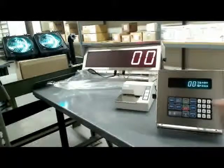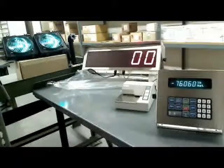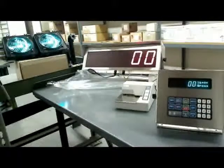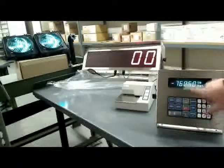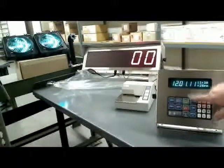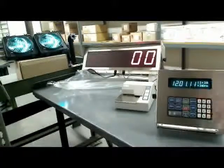If you hit Select, it'll go to Net — don't worry about negative nets. This is all done during the calculation of looking at axles. If you hit Zero, it'll automatically clear any tare value you might have. So with Scale Select you go to Net, hit Tare, and it zeroes out the tare. Then here's the time and date: 12, 01, 11, and then the time.